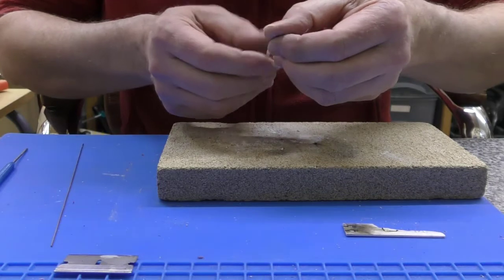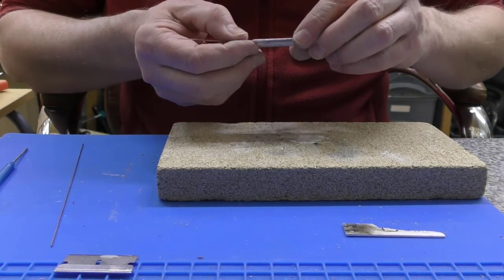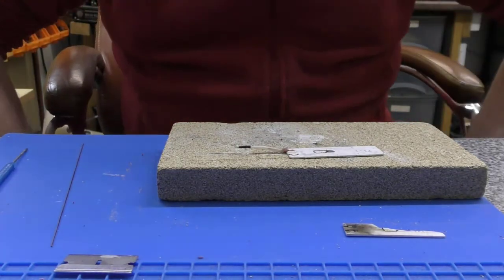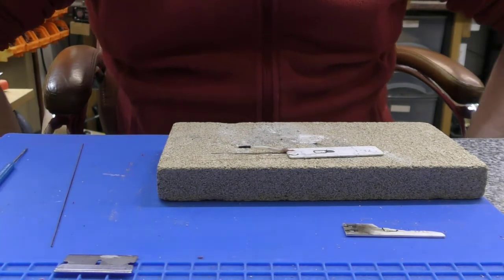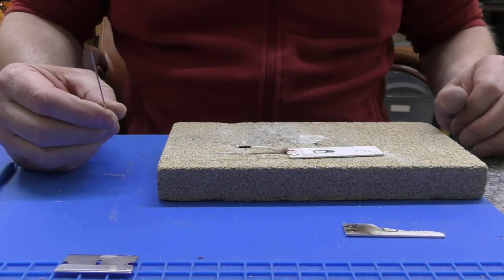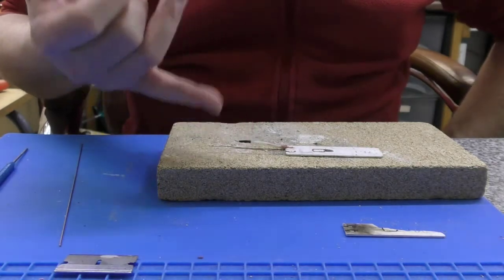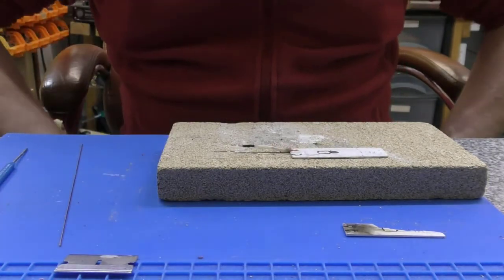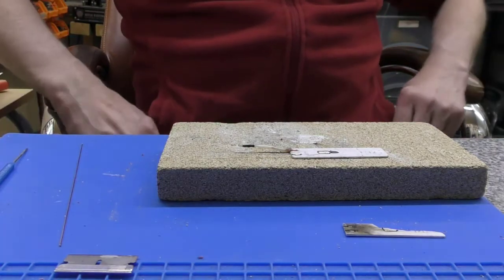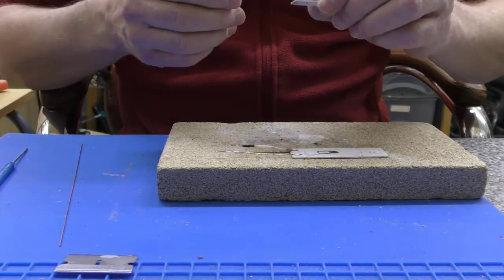So yeah, there we go. We can now repair these connections at least back to factory standard. So yeah, very pleased with that. Okay, so that was it really. That works. I was probably worrying a little bit too much about removing the old wire, but as long as we can get silver solder to take at that really high temperature, we're done. I don't need to worry too much about the old wire. And then we can sleeve this and over sleeve it as well with silicone, a little piece of eyelet on the end, and we are done. Sorry guys, that really wasn't up to a fantastic standard, but I've done this for the first time in front of the camera, and been messing around. So yeah, sorted.